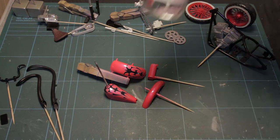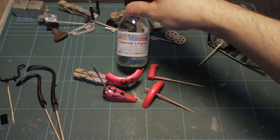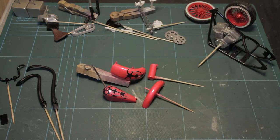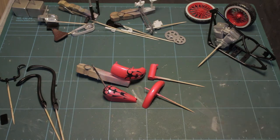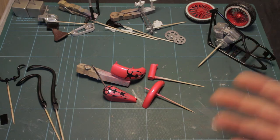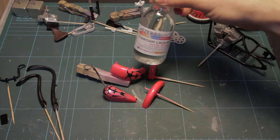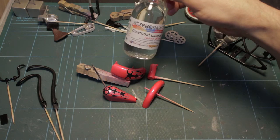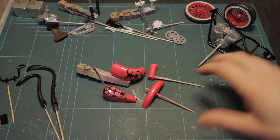The next thing to go on is clear coat, and what I'm going to try for the first time is Zero clear coat, which is pre-thinned lacquer or cellulose clear coat — nice and crystal clear. I want to try it as an alternative to enamel because I really like the hard finish, but oil-based enamels can have a tendency to yellow, and in fact the varnish out of the tin is a little yellow. The pre-thinned lacquer should dry nice and hard and still allow me to polish it up.